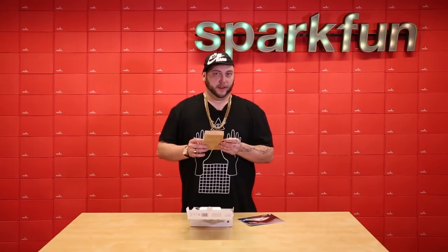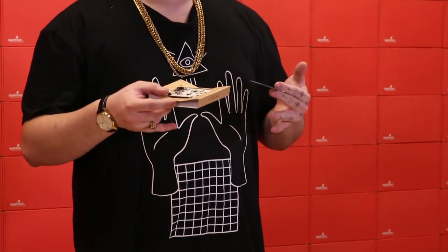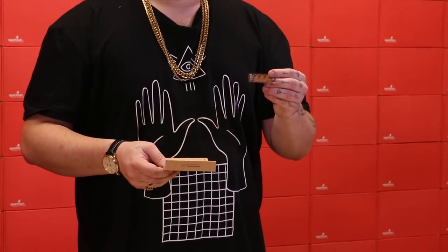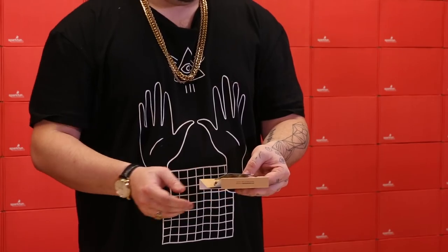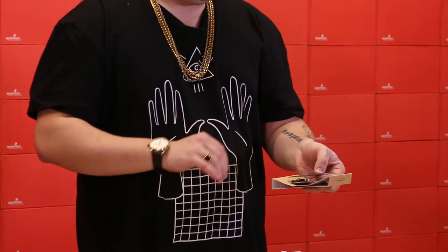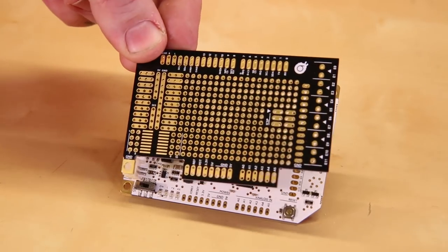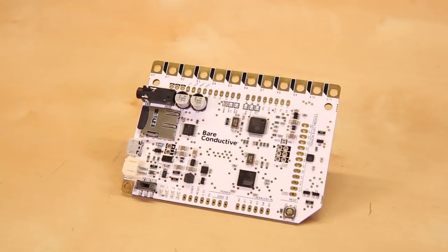Something that's new to this kit in particular is the ProtoShield. This ProtoShield is a response to people wanting a more secure and robust way to connect things to their Bare Conductive TouchBoard. The touch board has always had Arduino compatible headers, but this ProtoShield uses those headers to its advantage so that you can connect it on top like this and it allows you to connect wires using screw terminals on this side or any of this proto space over here. This version has little cutouts for the power switch and reset button, so it's really designed to work with the form factor of this board in particular.